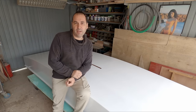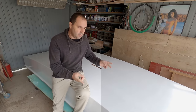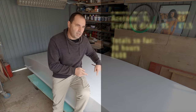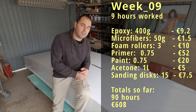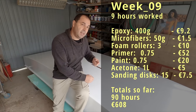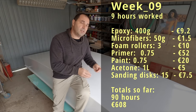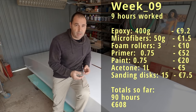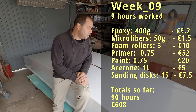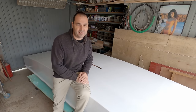I didn't manage to get back in the workshop to do anything else this week, so that's all I've done. Next week I will turn it around, put the stiffeners on the bottom on the inside, do the reinforcement on the transom for the gudgeons which I haven't done yet and should have done already, then do all the rounds on all the sharp edges, apply epoxy, primer, and paint. And I'm not sure if I'll have time to start the varnishing on the cockpit, but we'll have to wait and see. Stay safe and I'll see you soon.